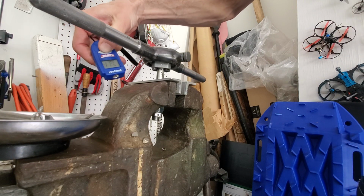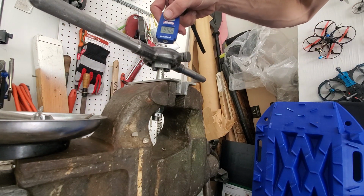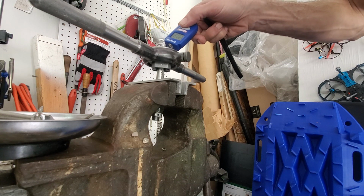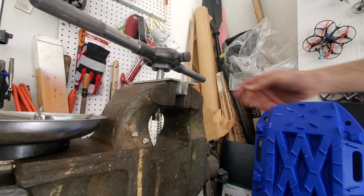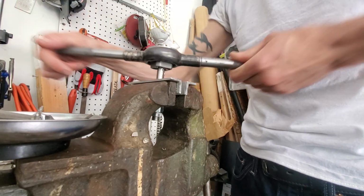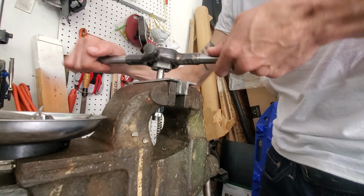The vise itself is coming in at 72.9. The table says 73.1. And here we're at 106, 109, 110, 115.6, 120 right in on those threads. So you could see we're up 40 degrees just on frictional rotation. And don't forget, man, you got a lot of steel here, and aluminum. That's not even warm. Heat sinking.